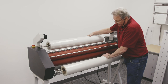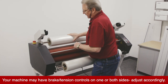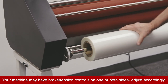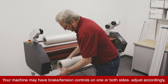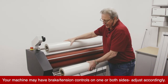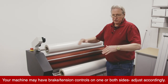Now I'm going to add a little bit of brake tension because I don't want these free-spinning while I'm doing the threading. I'll add a little brake to the top — just turning this to feel the resistance — and do the same to the bottom. I want these as close as possible during this process and we'll fine-tune once we start the actual lamination. If brake tension is uneven from top to bottom, the tighter side causes the finished product to curl. More brake on top means the output curls up; more on the bottom means it curls down. You want to get this as level as possible for a nice flat finish.